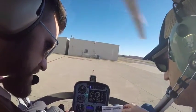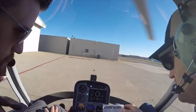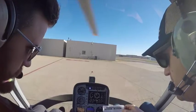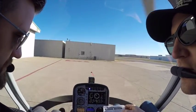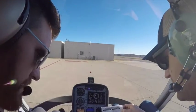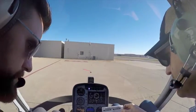Next thing is a roll-off throttle — under grip on that throttle, left pedal on three, two, one. Good needle split — our engine RPMs drop and our rotor RPMs are fine. I added left pedal just to make sure it doesn't torque. All looks good.